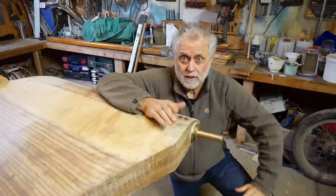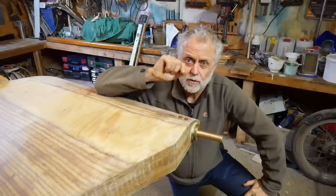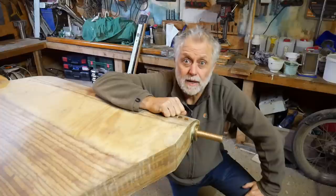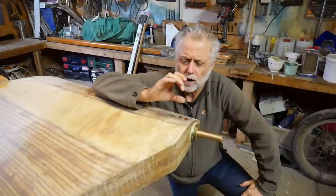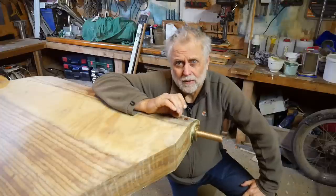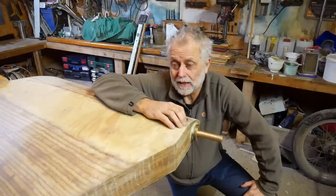Another thing that I did was to cut the hinge pin that goes through the upper rudder hinges, cut that to length, and drilled a couple of holes for it to accept some stainless split pins, cotter pins. I bought some washers that are supposed to go under there, but the ones I've got, I'm not happy with. The hole's a bit too big. Bigger than spec said they would be, actually. I'll keep them, but I've ordered some new ones. They're on their way, that hopefully will fit that better. Should do according to the specs. Time will tell.